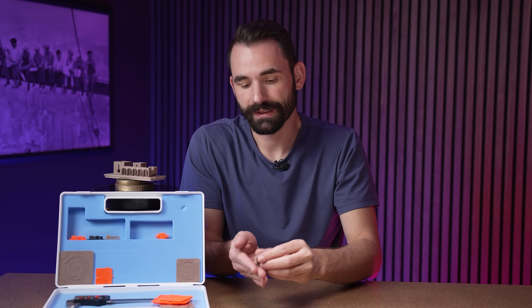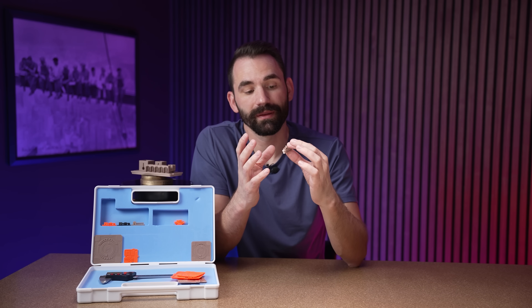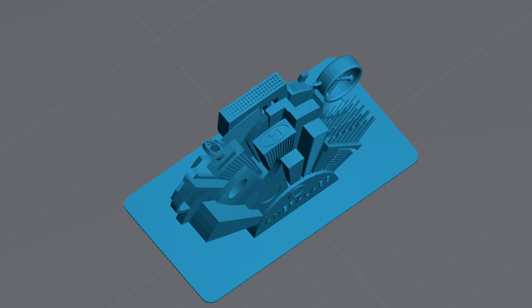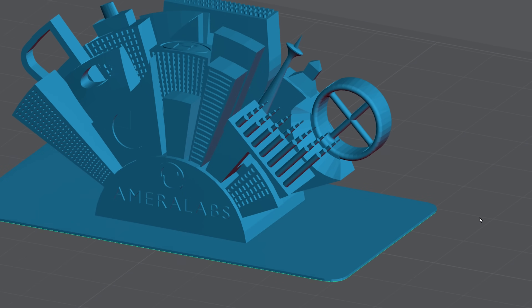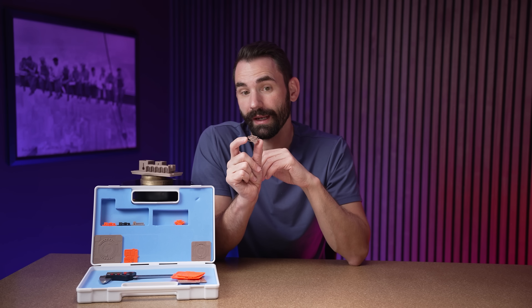One that I like a lot, and one of the older ones I was first shown, is the Town. The thing I like about Town is that it has visual components of both accuracy and strength. The part most people pay attention to are the checkers on the bottom and the pillars on the front. If you increase the exposure more, you'll get more pillars, but the checkers start to flatten out. If you decrease the exposure, the checkers print more properly, but you lose pillars. So this is more of a give and take — you, the user, get to pick whether you want more hardness or more accuracy. It's one of the few that lets you visually see which one you're getting or losing.